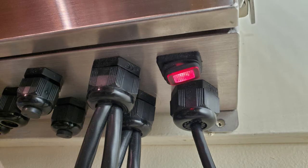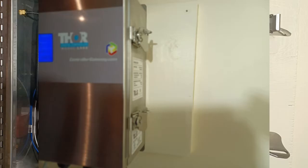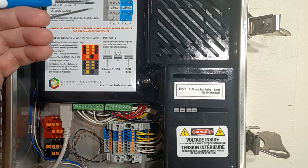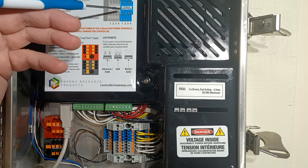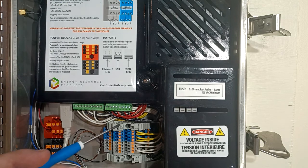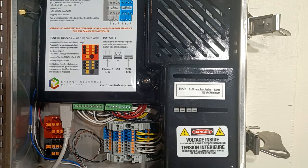After that you're simply going to unlatch the device using the latches on the right side of the unit. After you've done that and opened it up, as you can see here we have our sticker that totally mimics everything that's down below. You have your dry contacts in gray and your analog inputs in blue. You will not be using the upper right-hand side of the diagram because these are all pre-wired from the factory.